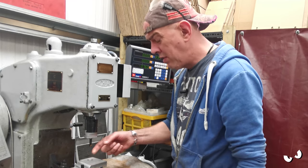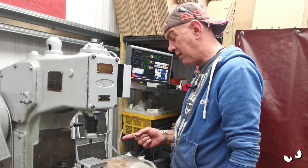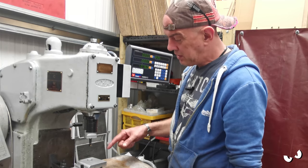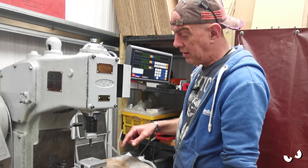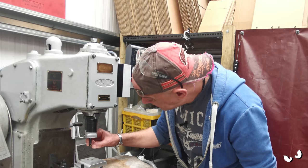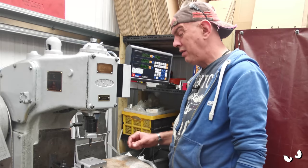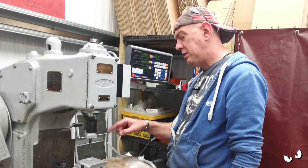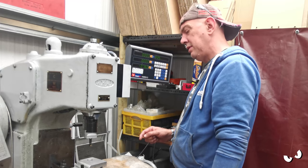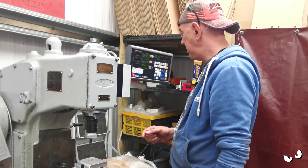And I think that line that you leave is supposed to disappear. I didn't ask him that bit, but that would make sense, wouldn't it? What I've been doing is kept it running and just retracted the tool. There is an angle to this. It's not much of one, but apparently if you do that, then the tool's just rubbing. It's not really cutting as it's designed to when it goes down. So, something else I've learned today, eh?